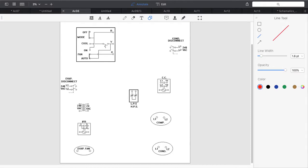In this video, we're going to continue our conversation on schematic diagrams. If you take a look now, we have a pictorial up that contains two disconnects. Let me tell you why this is important. For most of our air conditioning systems in residential and light commercial, until you get to the package unit stage, you're going to have an inside disconnect and an outside disconnect. There's going to be two sources of power. The only connection between the indoor and outdoor unit is some low voltage wiring, usually 18/4, 18/6 thermostat wiring.